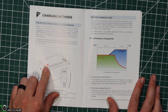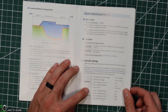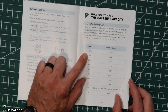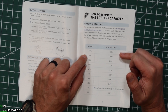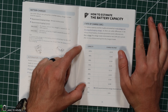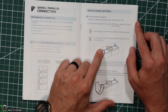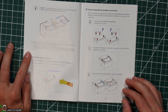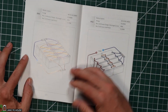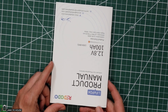The manual tells you how to check the voltage and has graphs for charge and discharge behavior, settings for your charge controller, and different ways to use alternators or generators. It also has a capacity chart: 100% is 13.5 volts, 99% is 13.4, and at 12.8 volts you're at 10%. The low voltage disconnect triggers at 1%, which is 10.8 volts. It also shows series and parallel connection options with wiring diagrams and battery balancing instructions. Just a tremendous amount of information in this manual, including inverter settings.